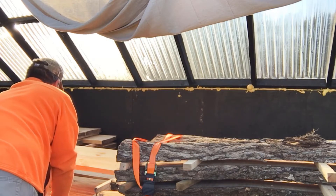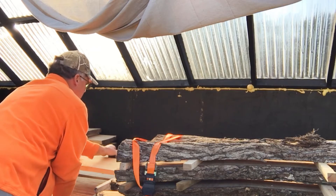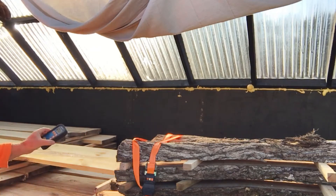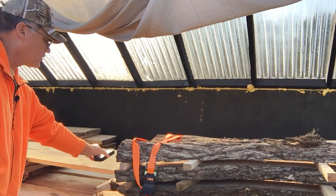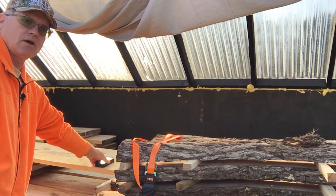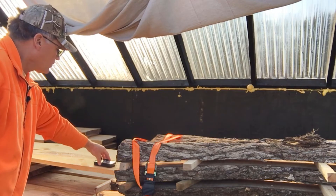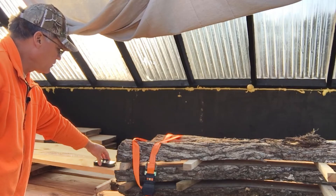I'm getting five percent. Five percent. What I've learned is you have to hold it down — because of sawn lumber, rough cut lumber, you have to apply pressure to make sure there's no air gaps between the meter and the wood.